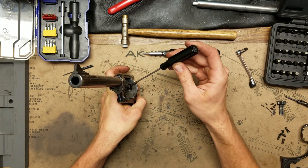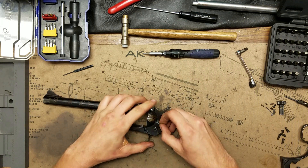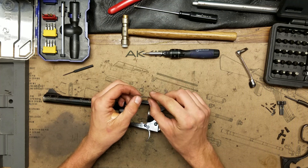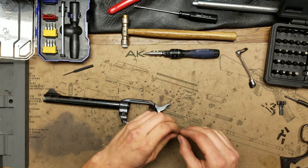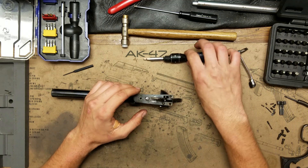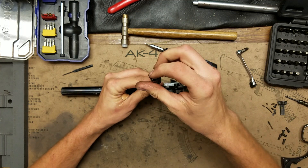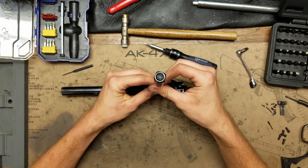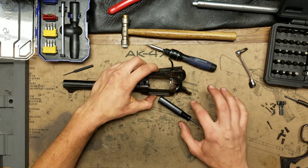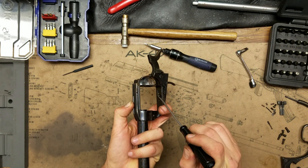We just have this upper assembly here. This spring is for the pawl inside, which rides up and down in there. Let's see if we can get it out — there's our spring, and our detent spring has a little kink to it, we may have to replace that. Now we can take out the screw on the bottom, which is the tensioning screw for — the lock, pretty much — the part that pops up and locks into the cylinder.